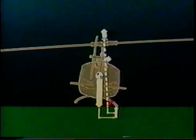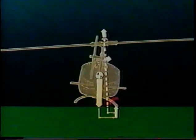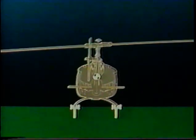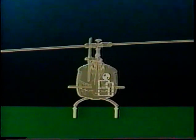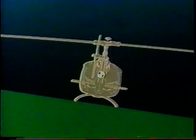Now the left roll moment due to aircraft weight works for you over its long arm, overcoming forces up and to the right. If you do all this soon enough, and remember, you've only got fractions of seconds to play with, the aircraft should settle and you can start the takeoff all over again, with better control this time. It should be obvious now that a left crosswind, CG offset to the right, or downslope to the right, are all complicating factors that aggravate the problem by reducing the critical angle at which rollover will take place.